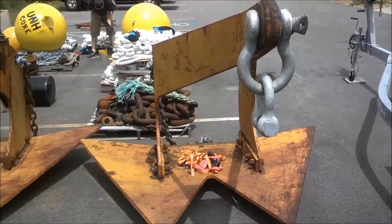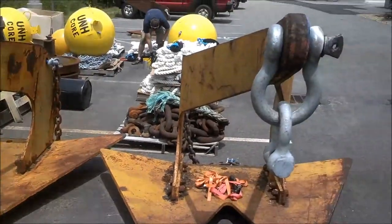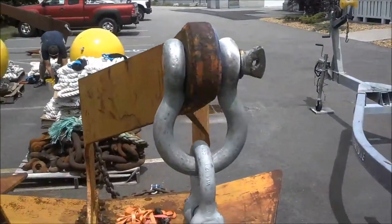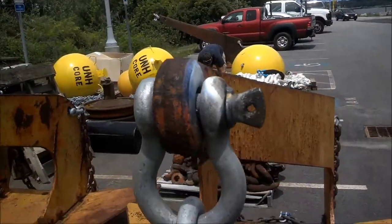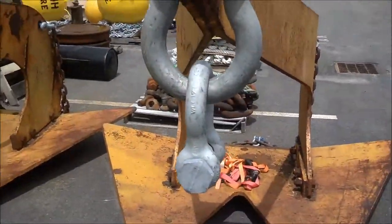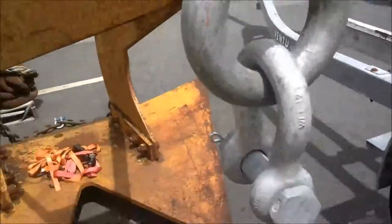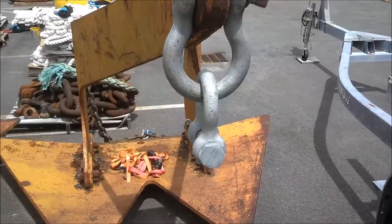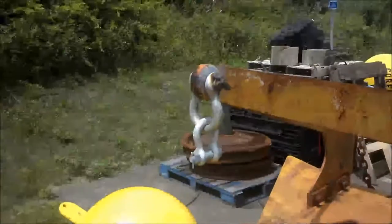Here's a video of the current status of the Ascilla mooring. We have the two Jaycos right here. We had to buy inch and three-quarter shackles to fit on there. They're two-piece shackles, so we welded the pin, and we have the one and three-eighths set up so those will go right on to the one-inch stud link, and that's set up on both of these.